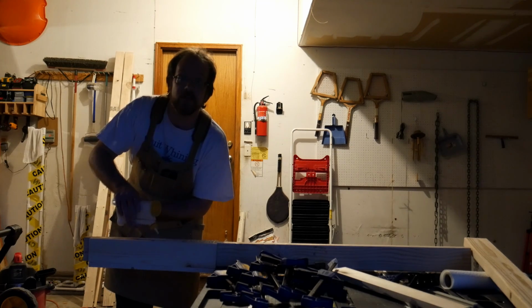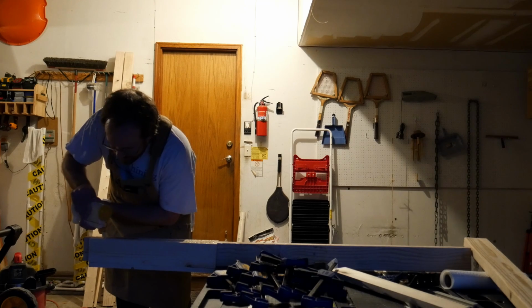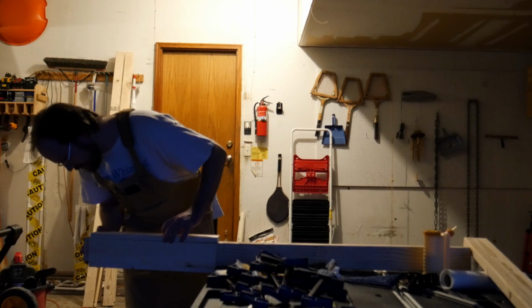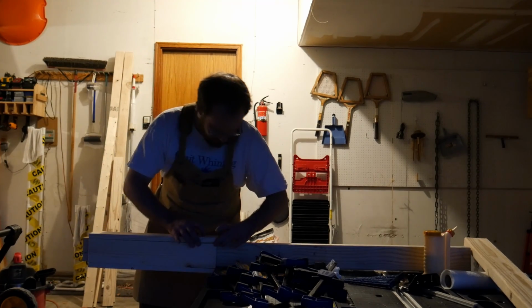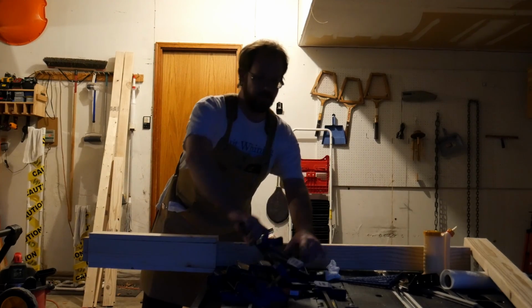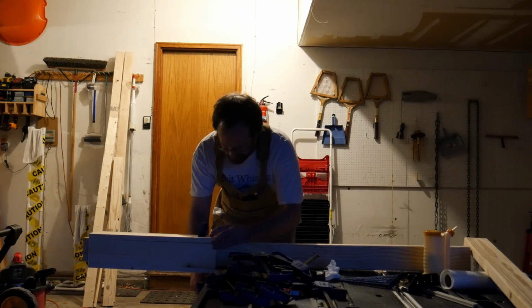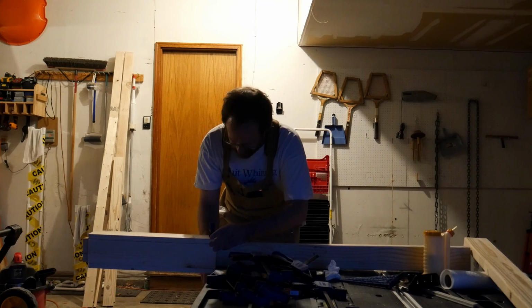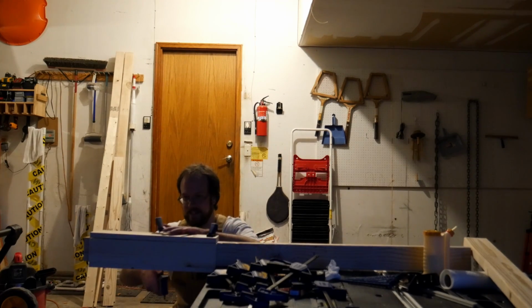With the lights going out, I'm not sure how well you can see this, but it's exactly the same process as before. And again, I've left the 2x4 in as a spacer, the loose one. That'll sort of hold everything, make sure everything's in order, let's say. Then once it's all clamped down, I can remove the spacer to make sure it doesn't accidentally get glued in place.